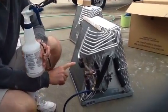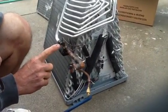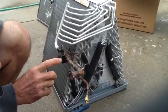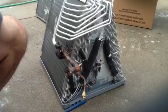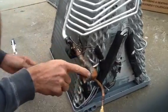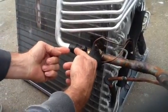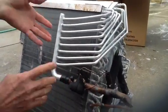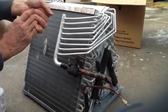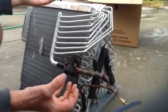We actually had a leak in this aluminum coil, and most manufacturers require that we not only determine the leaks in the coil — or we have to pay for it — but we show the technicians and the manufacturers how we actually find a leak. What they're doing here: they've got copper here, but they have a patent heat-shrink type device that connects copper to aluminum, tying everything together. Then the whole coil is aluminum. The reason it's aluminum is because it keeps down acids and keeps down corrosion — it's a healthier environment for the customer.